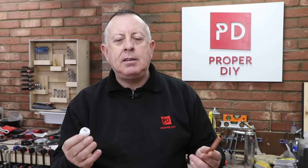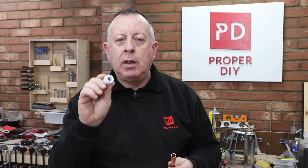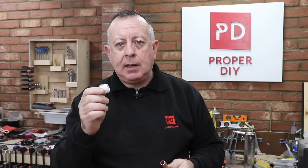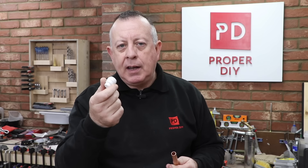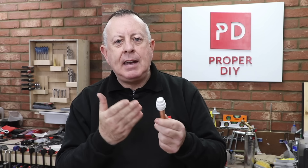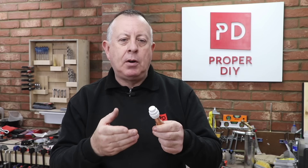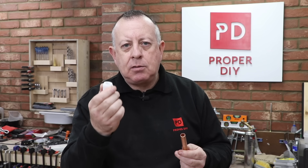The last option, which is the easiest and the one I'm going to use today, is the push-on plastic fitting. These have been around for some time, but for many years I was still using compression and soldered fittings because I thought these would just push off under the pressure - but they don't, and I'm now converted. If you're doing a small job at home, look into using plastic pipe and plastic fittings, although these fittings also work on copper. This one is a Speed Fit, which is a fairly classic make - I'll put a link in the description. With a cap and stop end like this, you just prepare the copper pipe, making sure it's smooth, and push it on. That is now done and will stand mains pressure. If you want to take it off in future, you just hold the collar and it slips off.